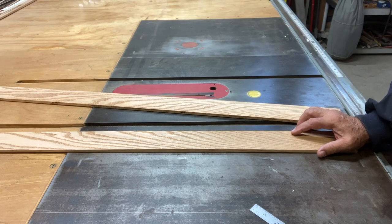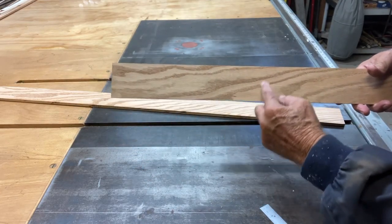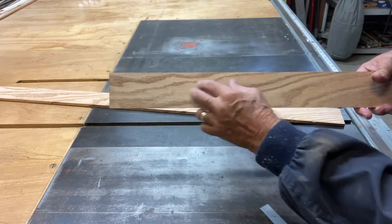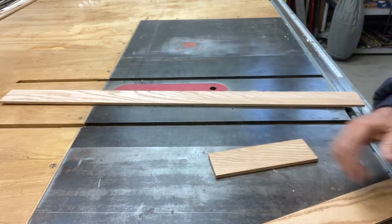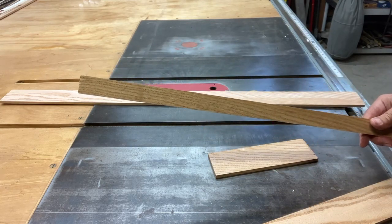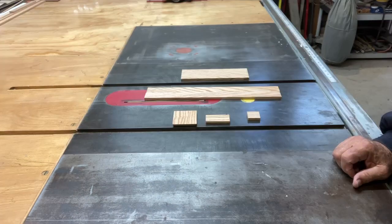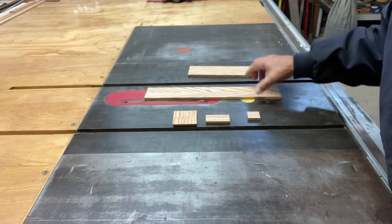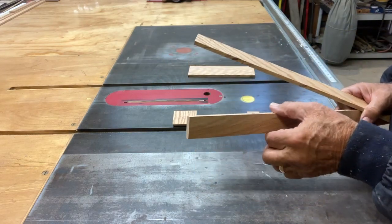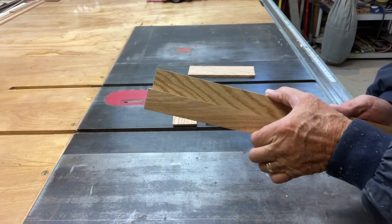The square in the puzzle is going to be about two and a half by two and a half inches, so everything is based on that. I'm going to cut nine inches off — one for the square and two extra in case I make any mistakes. Take your excess piece left over after cutting the nine inches and slice two sticks. Mine are one and a quarter inches wide, so one and a quarter plus one and a quarter is two and a half inches — that'll be my square. By now you should have your nine inch piece and your two sticks, each one and a quarter by whatever length.